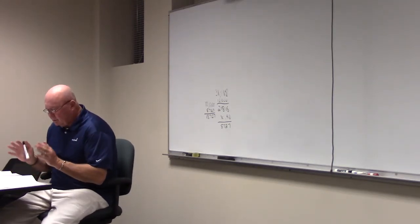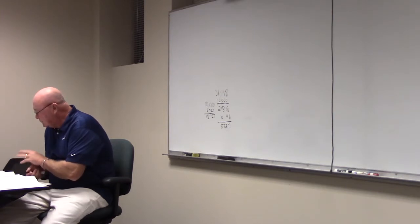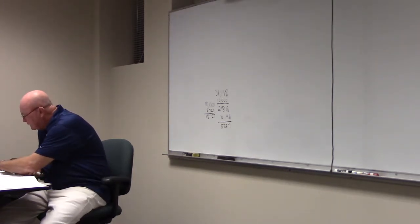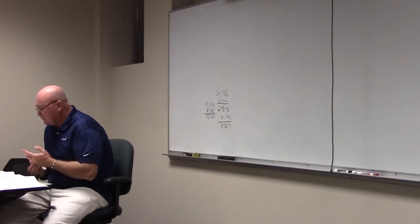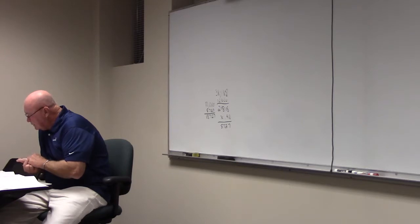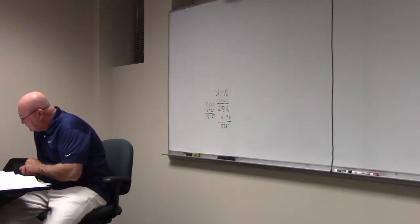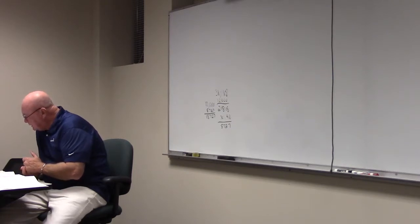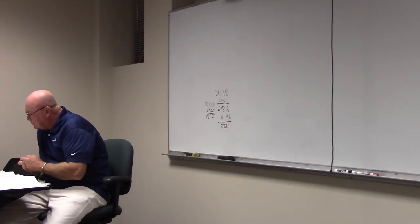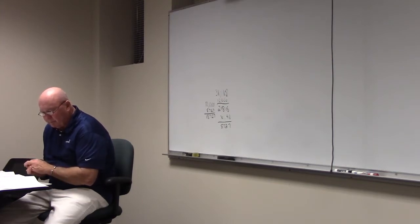Then step number three says you have to do heating and air, but there's a different rule for heating and air under (C) on that same page in your code book. Let's look at (C). Because you look at step number three, it says air conditioning is 100%. Y'all see that there? 100% of the nameplate of air conditioning. That's number one under (C). Y'all see that? Central electric heat, if you go down there and look, you find that central electric heat is 65%. So the central electric heat to me would be listed under number four, electric space heating of less than four separately controlled units. Or, yeah, if a heat pump, so I think that's where we'd list that. So 65% is the heat, which is 9,360. That tells us what our heat was. And so which one is larger?